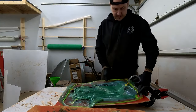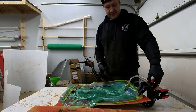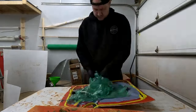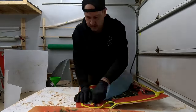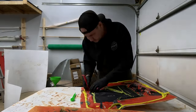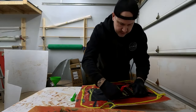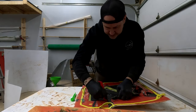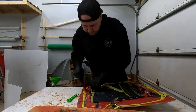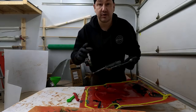It's been about six hours. We're going to take this thing apart — it won't be fully cured yet. This epoxy is a 36-hour full cure, but it's 12-hour sandable so it should be relatively hard. Let's see what kind of release we get here. I'm actually curious how the product turned out because I had it sitting leaning against the garbage can and at some point it fell over upside down. That doesn't look too bad — it probably looks rough because it's got all that PVA on it. I'm going to clean this up and come back and show you.